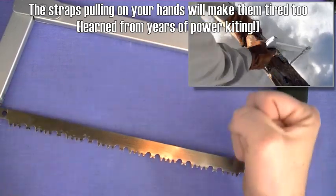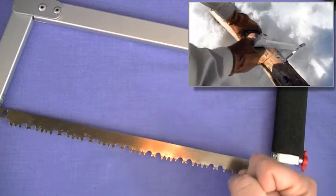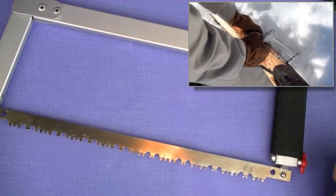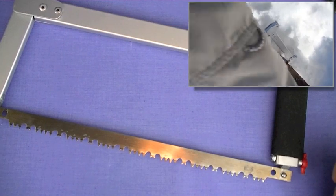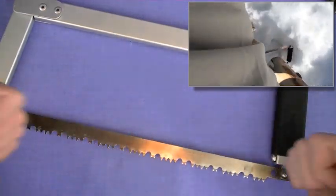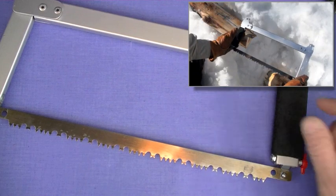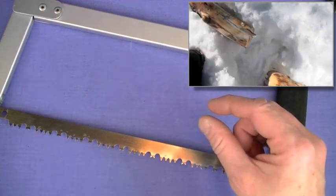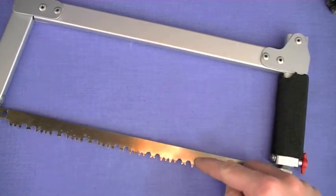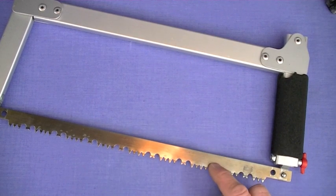Maybe I'm pulling like that, and that would actually be pretty decent. I think, though, over time, and I have used them before, they are going to require more energy. Okay? And they just suck with one man. If you have another dude on the other side and you guys are doing it old lumberjack style, he's pulling one side, you're pulling another, I think you can probably rip through some wood pretty good. But they also have a very wide kerf. Remember, it's a chainsaw blade. And that means you're removing a lot of wood, or at least more wood than you would be here. That takes more energy. And also, it's going to bind more than the Sawvivor.